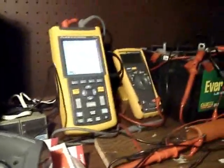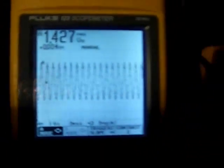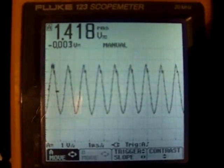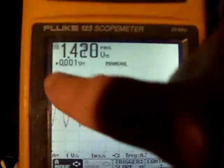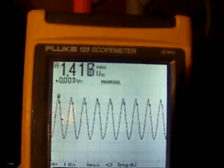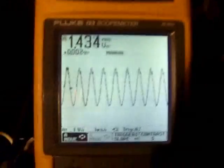What I'm going to show right here is this — this is what the waveform looks like on the load. Basically very pretty symmetrical. I can smooth it out if I want. Right now it's hovering right about zero DC and about 1.4 volts RMS. And this is made possible by a timer circuit with no caps on it.